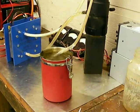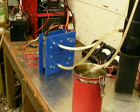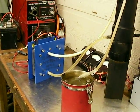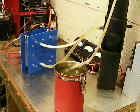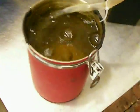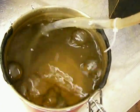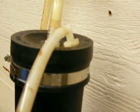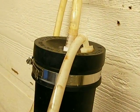Advanced hydrogen — popping some bubbles. I've got my flat cell running at about 16 amps, about 12-13 volts, not really much output. I have a torch, and kids, don't try this at home. Notice the metal container — my reservoir has a rubber blast cap. Don't ever do this with a glass container.